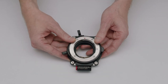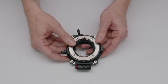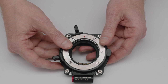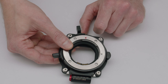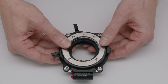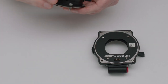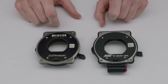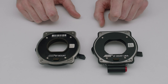This mount is not only a mechanical element — it's also an optical element. There's no glass in it, but we still have to prevent unwanted reflections because reflections limit contrast, and we want as much contrast as the lens can provide. So the material, shape, coating, and so-called light bevel inside are very carefully optimized to eliminate unwanted reflections. Looking at the two mounts side by side, you can clearly see the size difference in the opening: the existing EF mount without LBUS is only made for Super 35 sensors, while the new one with LBUS is capable of covering Super 35 and large format sensors.